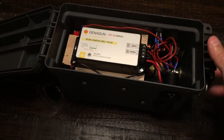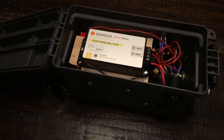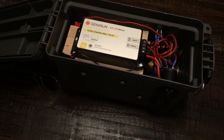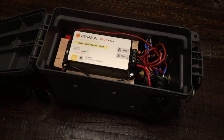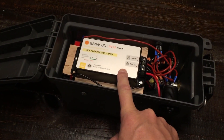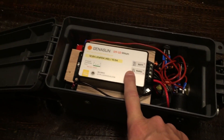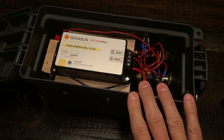I bought it with the battery charger that's paired up with the battery, and it came to around $130. So you've got to weigh out weight and greater capacity versus cost. If you doubled the capacity to get two batteries, you're doubling the weight on the AGM side — there are just trade-offs. Also, this controller was not cheap and not the easiest thing to find. You have to make sure you look at the output to the battery to match up what the manufacturer suggests for their battery, as far as constant current and constant voltage, which I did and verified with Kevin before I bought it.